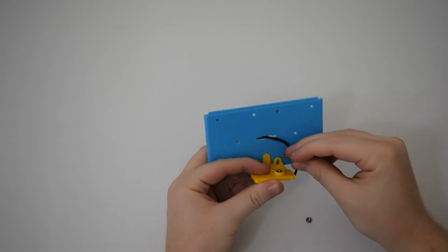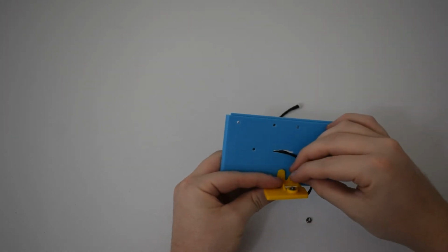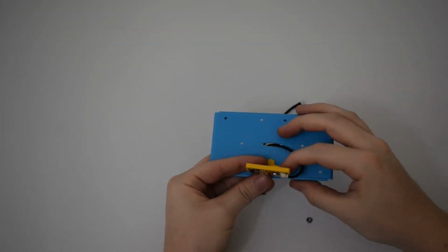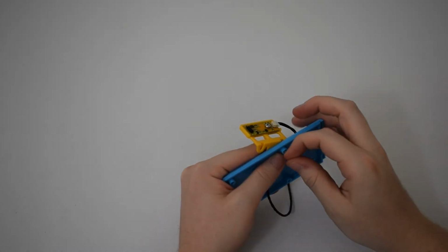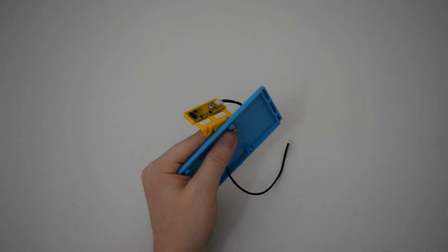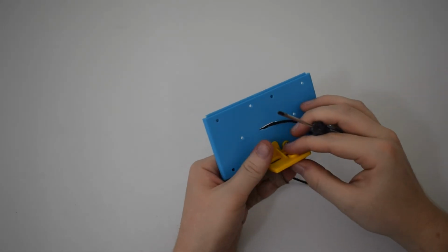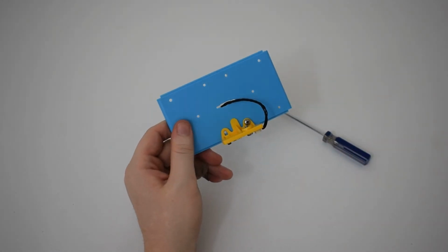When screwing on the head mount, we want to make sure that the distance sensor is facing outwards. The long screw should go in the hole with the extra bit of plastic at the bottom. Add a bolt at the bottom to secure it. Then use the shorter screw to go through the other hole.